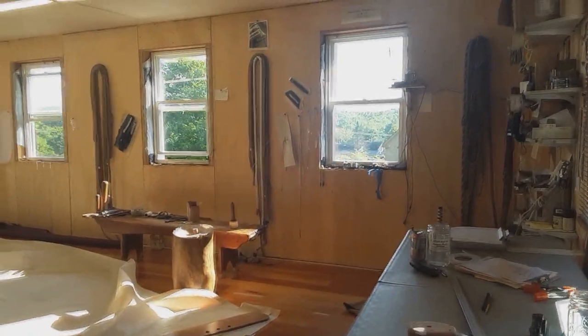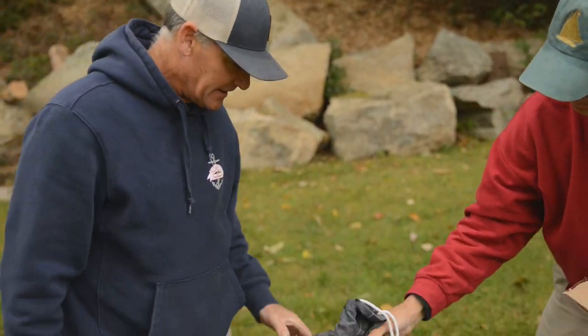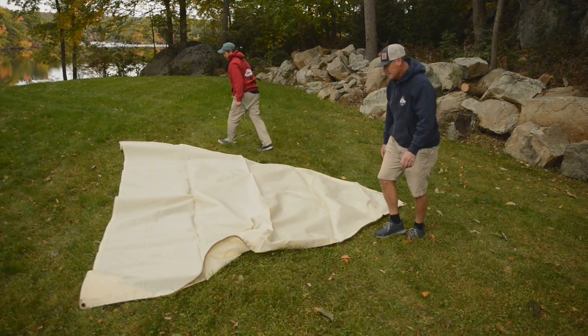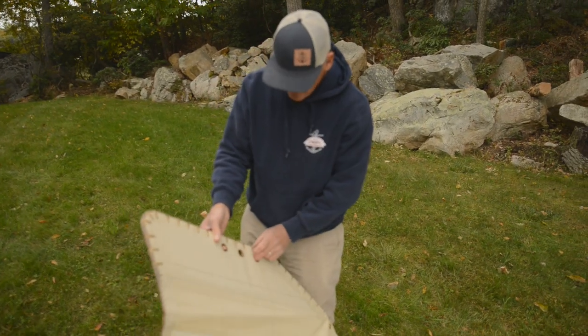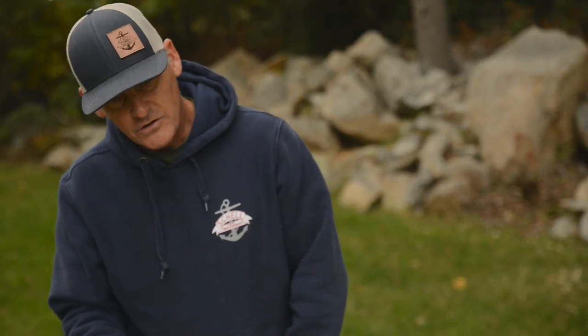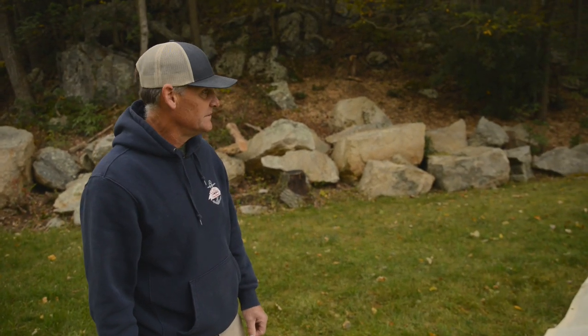Dale from Traditional Rigging at Appleton, Maine made us a traditional sail for the 14-foot Abaco dinghy. We're going to pull it out of the bag and lay it out — beautiful. Hand-stitched bolt ropes, vertical panels, and she built us the Abaco-style banana board, as they call it, for the head of the sail, which is really cool. It gives you three options for hooking up the halyard and adjusting the tension of the leech. If you hook it to the outermost ring, you get a little more leech tension. It's a pretty interesting way to build a headboard — a banana board.